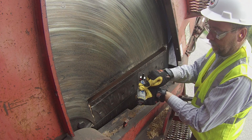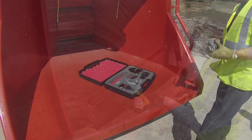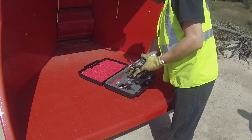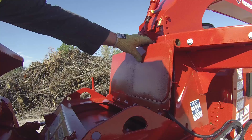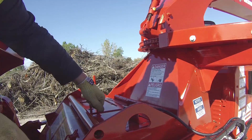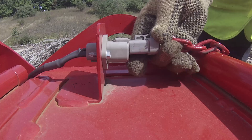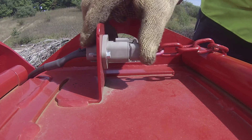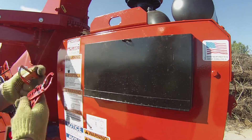When sharpening is complete, turn the unit down to the slowest setting, and then turn it off. If using a battery-powered unit, remove the battery. Finally, place all components back into the storage case. Close your chipper hood door and replace all hood pins and safety switches, making sure they are securely attached before chipping resumes. Finally, remove the lockout tag-out and your chipper is ready for use.